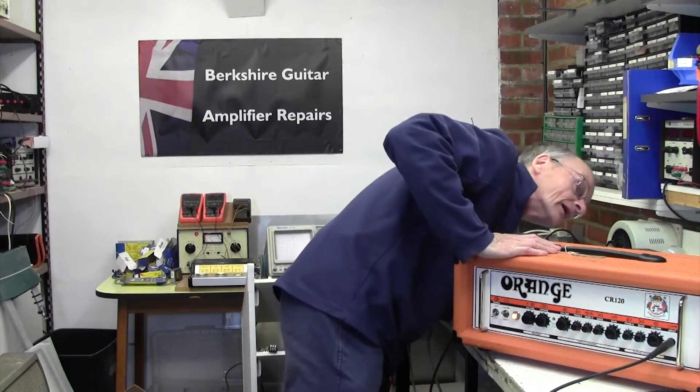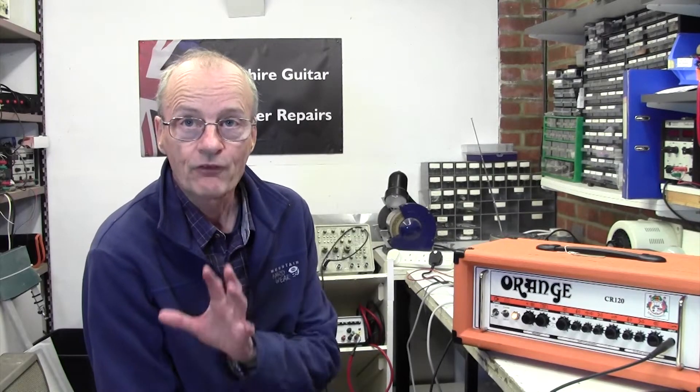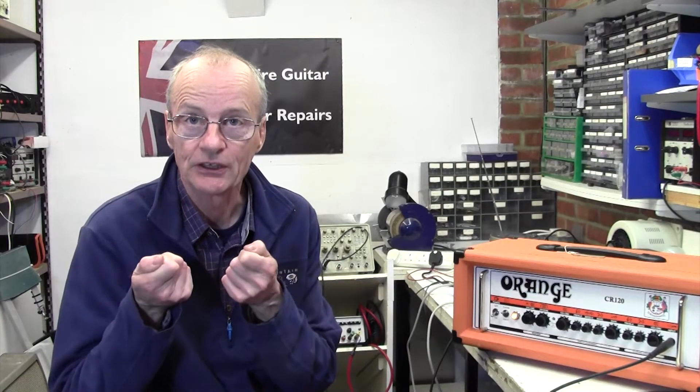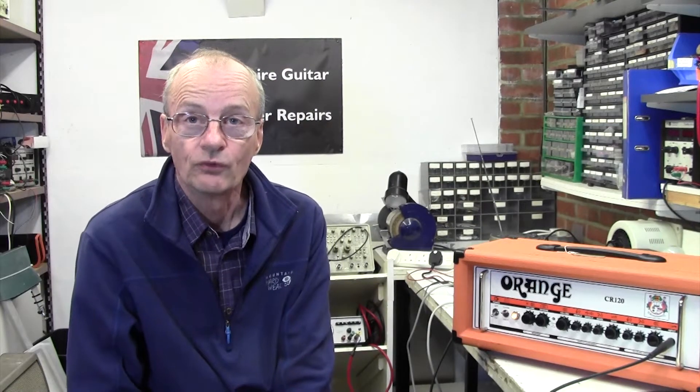I'll just have a look on the back. Okay, there is an FX send and return jack, so I'm going to leave this now for five minutes - turn the camera off and come back. If the sound's gone, the first thing I'm going to do is take a short jack lead, jack to jack, and plug out the FX send and return. If the sound suddenly comes back, we know exactly what the problem is - dirty contacts on the jack sockets. So I'll turn the camera off now. I'm going to have another cup of tea - I am English after all. I've only had 114 cups today, and then I'll come back in 10 minutes and we'll see if it's alive or dead.